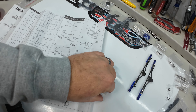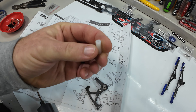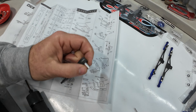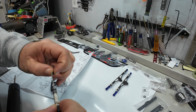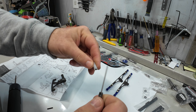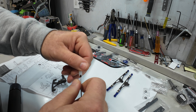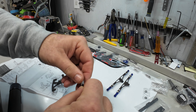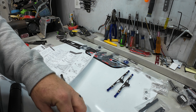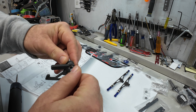Step number six — it took me a while to find this hex tube. It's white. It is in bag 17, so that was correct and labeled, but I assumed it was something different, maybe metal. It then tells you to put an M3x10 hex bolt through it into a metal threaded part at the bottom. But if you thread the M3x10 all the way into the plastic piece, there are literally only about three threads hanging out — that's not awesome. So I raided my spare parts for an M3x15, and that way I can thread it all the way in and there's still plenty of material sticking out to screw in securely.